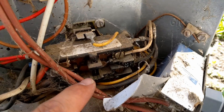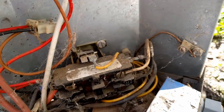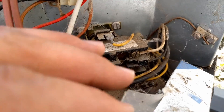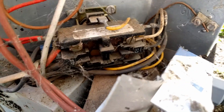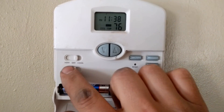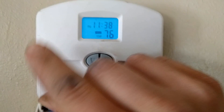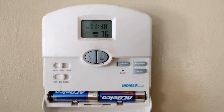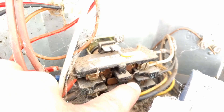Now, there's still 24 volts coming to this contactor because it's still being pulled in, and that's because that power for the contactor comes from the furnace itself. So we could either go turn off the thermostat so that the air conditioning is not calling, or we could shut off the breaker to the furnace. Either way, I think I'll turn off the thermostat. Here's our thermostat. We're just going to set the fan to auto — that's already on auto — so the system to off. The cool indicator went off, so there should be no power coming out to the unit on the control wiring. So the contactor is no longer pulled in, which means we don't have power out here.